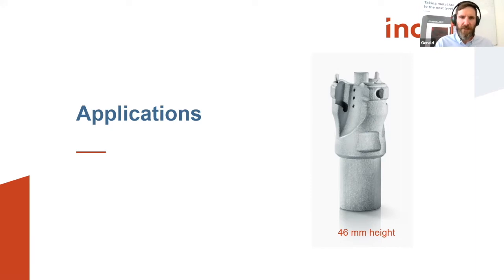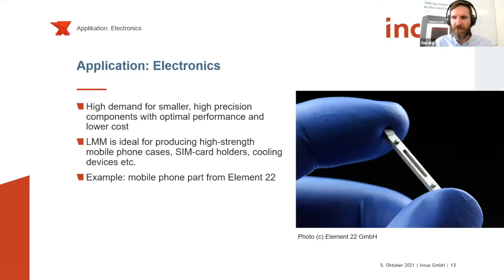So once again, this should show that you can achieve the highest resolution in terms of additive manufacturing for metal materials. Also, what I always like to compare is this part. This is a part of a cell phone or a SIM card holder, and you see also the untreated surface, and you see the comparison of the texture of the glove compared to the texture of the untreated part itself. So I would say the lithography-based technology has this really unique feature when it comes to small and complex parts, and this is where I see this complementary benefit for micro-MIM, because we have seen the really small and complicated, delicate parts before. This is where we're just unmatched in terms of resolution and surface aesthetics.